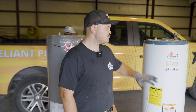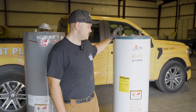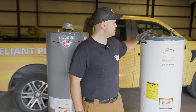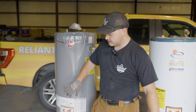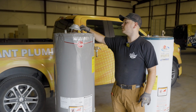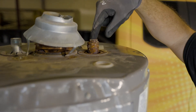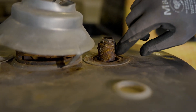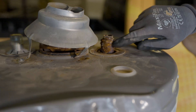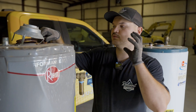I've got two heaters here. This one is an 18-year-old water heater that was leaking at the top and on the bottom. Both are natural gas heaters and this one is going to have a lot of buildup inside. This is an eight-year-old water heater that was also leaking at the top. I can see why — they ran copper directly into this galvanized nipple, which caused electrolysis. When you have two different metals touching each other, you get electrolysis, which causes corrosion and rust to happen very rapidly.